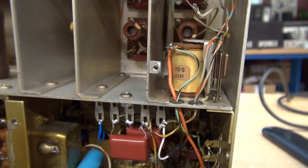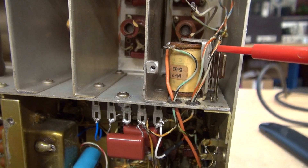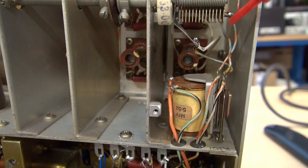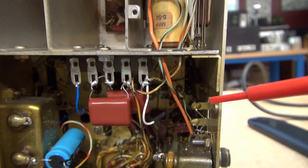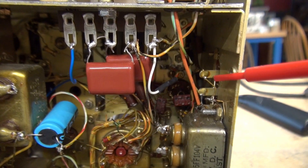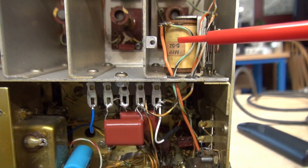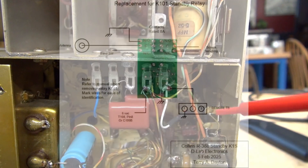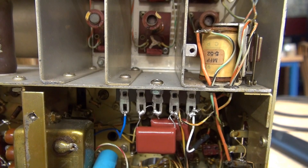Before you disconnect anything, it is a good idea to mark your wiring. The first two wires here go to a normally closed contact that switches the screens. The antenna switching is on the rear. The coil wires go down to the remote terminal strip. Normally there's 12-volt DC applied closing this relay, but the K1S will simply switch one of these terminals to ground, so you do not need an external DC supply.